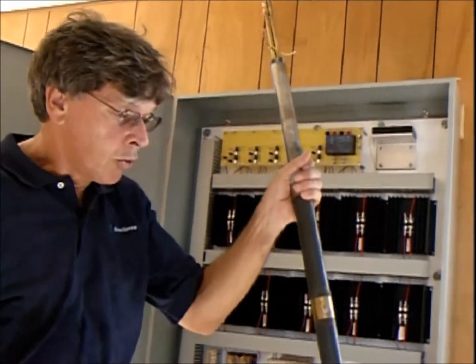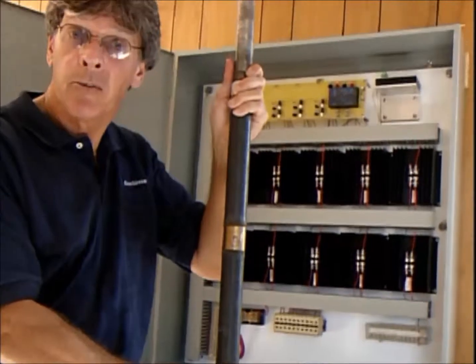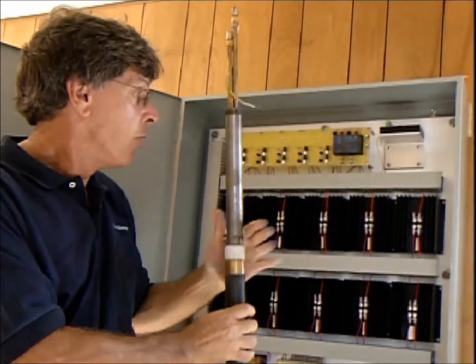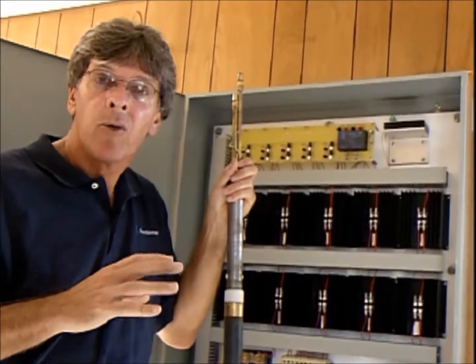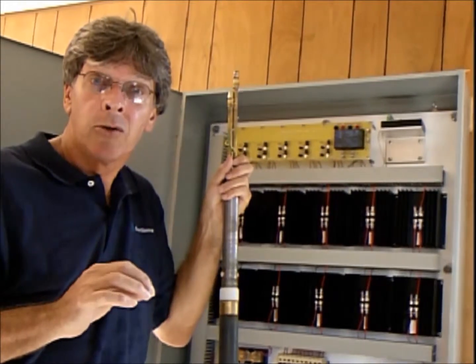And with this tool, there's no prediction involved. This tool will measure directly whether that site is applicable for this technology, and there's no guesswork. This quantifies directly that electro-osmosis will work. And you look at all the work of Casagrande over the last 50 years, electro-osmosis is a very, very powerful system to stabilize soils.